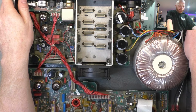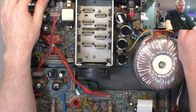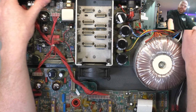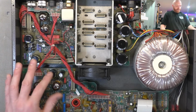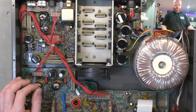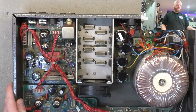So we'll just check that they're balanced, and we'll check for crossover distortion, and the tech note also says do not remove all crossover distortion. So as you can imagine, this is a great sounding amp with crossover distortion in the output stage, but hey, when your thing's cranked up, you don't really hear a little bit of crossover distortion in the note decay when you're pumping the thing at full volume.